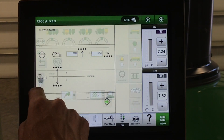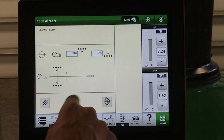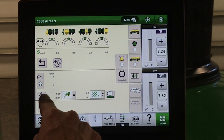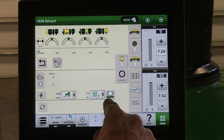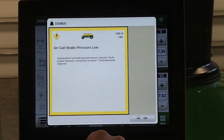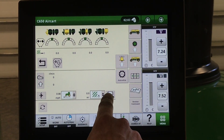Here, we can set our fan low speed alarms for our top fan and bottom fan, our clutch on and off, speed, and other selectables. And our cart braking — if you activate your cart brakes from the display, it will activate your cart brakes independently of your tractor, and you can do this until the green bar disappears.